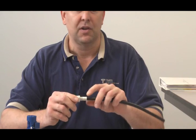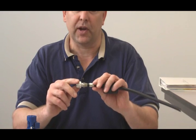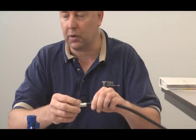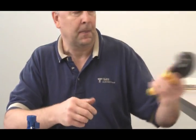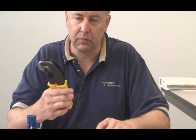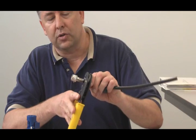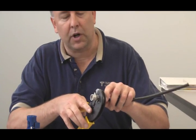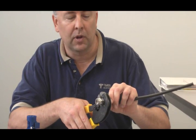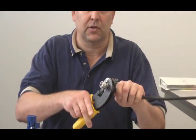As you can see, there's no braid protruding. It's been designed so the braid is just where you want it to be. Bring that ferrule up and you're set to crimp. We have our CT-300-400 crimp tool, 3190-666. Use the larger of the two crimp dies. You want to crimp it right up as close to the back of the connector as possible — bring the ferrule all the way up and crimp it right close to the connector.